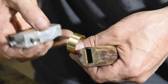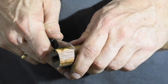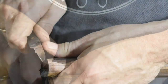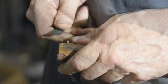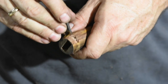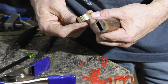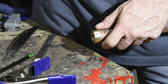Now I'll cut a seat for the ferrule on the handle. The ferrule needs to fit quite tightly, so you don't want to overshoot and end up with a bunch of slop in the fit — this means painstakingly test-fitting. Once you're almost there, resist the temptation to tinker to get that last bit dead perfect. You'll actually want to whack this into place so it's good and tight, and that means it's got to be just a hair oversize when you quit chiseling.